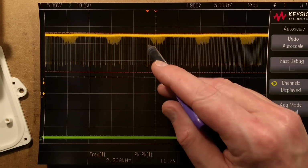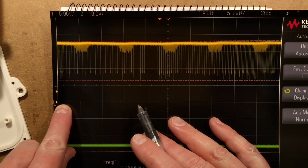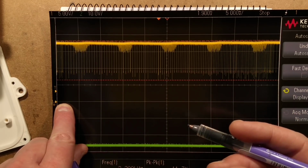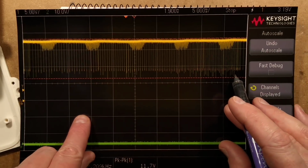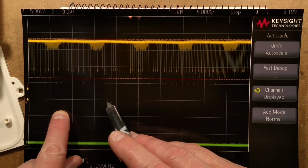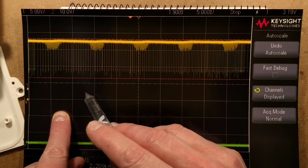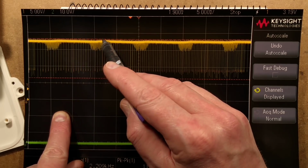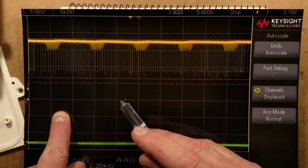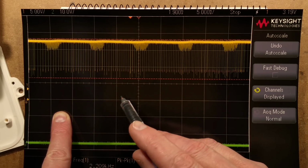The actual pulses, the transistor turning on, this down here is the 0 volt reference. If they'd had that resistor missing, so the transistor wasn't operating in an emitter follower approach, these spikes would have gone right down to the 0 volt rail. It would have created a much sharper spike. But as it is, the 17 volts here, each of these divisions is 5 volts. It's only coming down about halfway, so there's only a roughly 8 volt drop there. It's not really that huge, 8 or 9 volts.